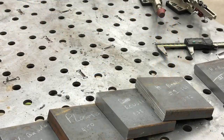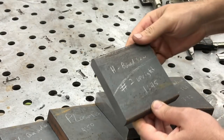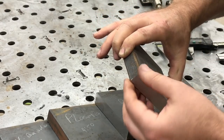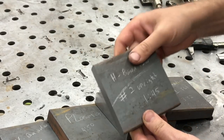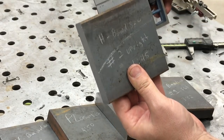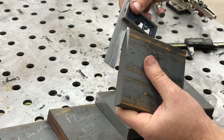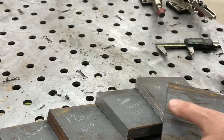Now let's zoom in and inspect the different cuts. This was the horizontal bandsaw cut — none of these have been deburred, they're just as they came off the saws. The bandsaw left just a very small burr that usually comes off on its own, and no burr on the backside. This was the piece we stood up in the saw — a minute and 45 seconds — and checking it with a square it's really only rocking a tiny amount.